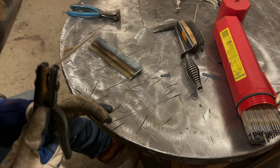If you're welding on much thinner material, say like 3/16 with the same eighth inch rod, you're going to have a tendency to actually come up over the edge, and your weld rather than being flat or somewhat concave, it's going to be more convex likely. But on this, I would have had to slow my travel speed down a lot more to try and get it to be closer to convex, more or less like it is here. So anyways, your rod angle, really important.